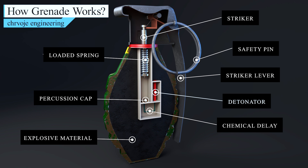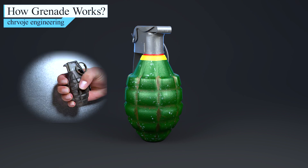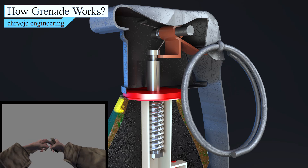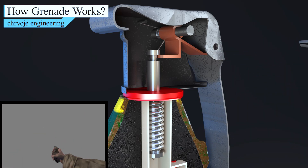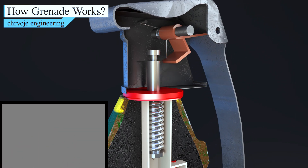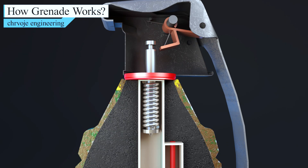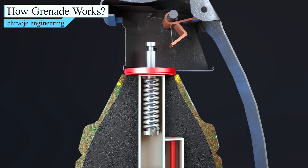So, the main question is: how will this grenade explode? The soldier grips the grenade so the striker lever is pushed up against the body. Then the soldier pulls out the pin and tosses the grenade. When the grenade is tossed with the pin removed, there is nothing holding the lever in position, which means there is nothing holding the spring-loaded striker up. The spring throws the striker down against the percussion cap.